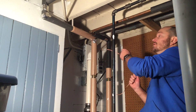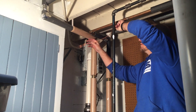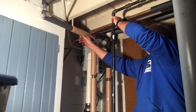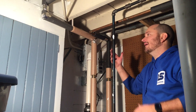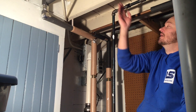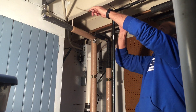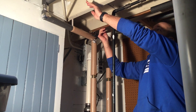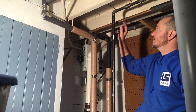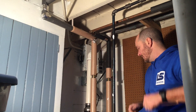The first thing I like to do is make sure that one line is going to be long enough for all three pipes. I want to find a location where it will easily reach all three — I'll just do it right here, I think this is going to work out really well. I have to cut back some of the insulation on the hot line. One issue is I was going to come across this way, but there's a soldering joint right here. I prefer to stay away from soldering joints as much as possible, because when you compress this on there, you don't want to compress the pipe and mess up the joint. So I'll just go from here, over to here, and cut that away.